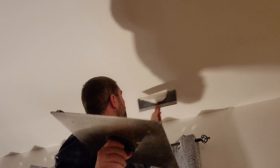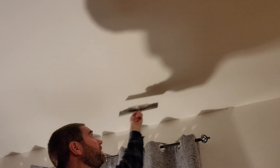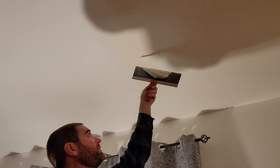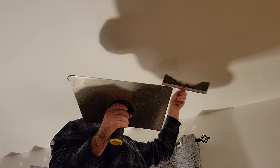This is where I did the tape and I had to do a repair of the ceiling. The all-purpose compound — you want it to be mixed up a little bit, but it really shouldn't fall off your drywall knife. Then I'm going to do one foot over — I've already put two light coats over the tape.